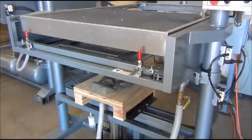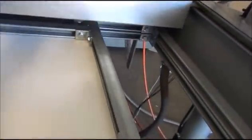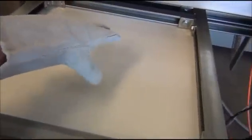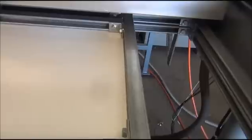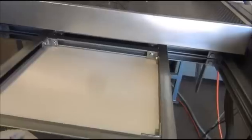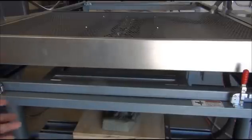We'll go ahead and insert some plastic into the machine and let it start heating up. Once it's ready, we'll raise the table and open the vacuum. Our plastic's been heating up for a minute or two. The most important thing is that the edges and corners are nice and soft — you should be able to poke your finger through there and it should stretch. The center of the material naturally heats up first; the last portions to heat up are the edges and corners. If they're not nice and soft, they won't be able to wrap around the top edge of the box solidly and you won't get a good seal.